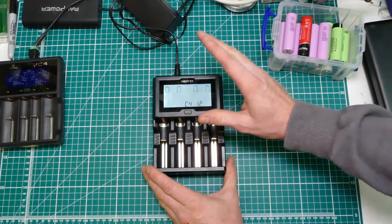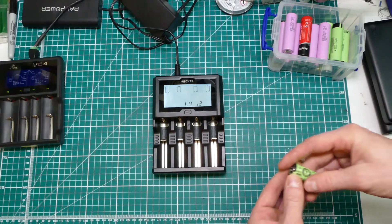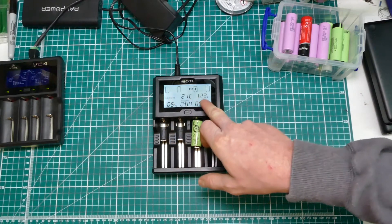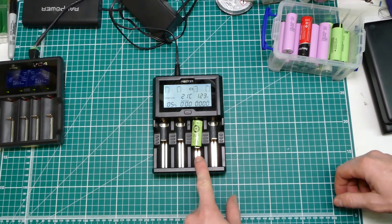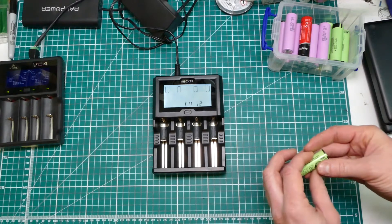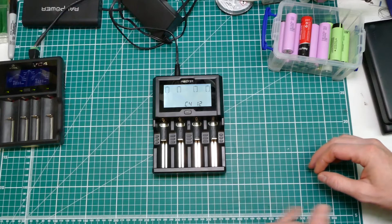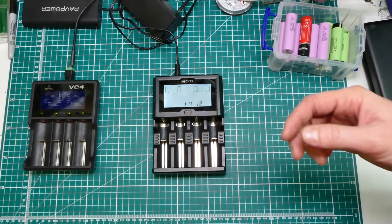Anyway, I've rambled on for long enough like I usually do. I can only suggest that this is going to be my go-to charger from now on. It will do nickel metal hydride as well - I popped a NiMH in there and it immediately comes up on the screen and works the same. It will give you an impedance reading and guesstimate the current. I have done a loop on it and it was fine, charged perfectly. I'll keep an eye on it and will update you if I have any issues. So though it's not quite perfect, I think it's probably the best four-bay charger on the market at the minute and I'm quite pleased with it. I can put this in the scrap bin. So thanks for watching, bye.